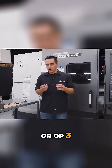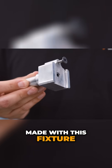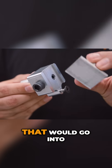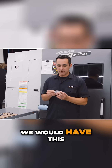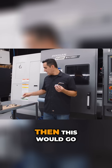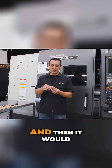I didn't really talk about Op2 or Op3. Op2 was made with this fixture, which went in a 5C rotary — we clamped on it, then took the partially machined part and put it into this fixture here. It has an integrated work stop, and then we would drill and tap, drill and counterbore, drill and counterbore.